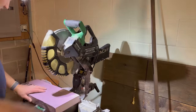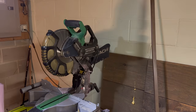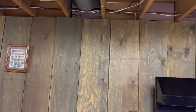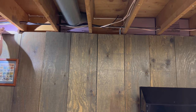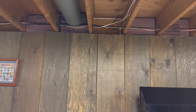Next we need to cut some of our foam insulation. I found the easiest way to do this is on the miter saw. For each dimension, say the height is nine inches, cut it eight and a half — subtract a half inch from each side. You'll want to leave a quarter of an inch all the way around for the spray foam. Fit each insulation piece in place, making sure you have a quarter inch gap all the way around. Here I'm using R10 insulation which is a two-inch insulation. I'd probably recommend anything with a thickness of one inch or greater, and then we'll prepare for spray foaming around the edge of each insulation piece and seal it in.